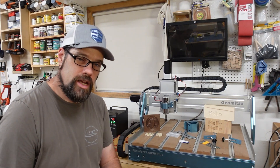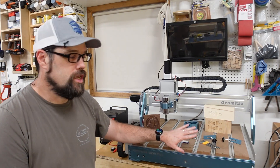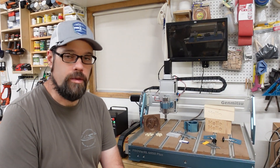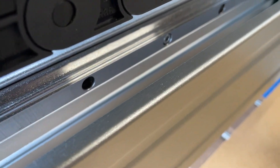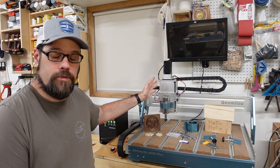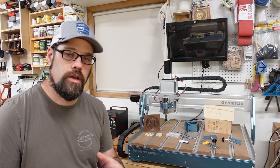It has a default setting of 2,000 millimeters per minute for its top speed, and I've heard from other people that they've pushed it even faster. You're going to need those robust motors to keep up those speeds. Along with that, they are using lead screws and linear rails — dual 15mm linear rails on the X-axis, dual 20mm linear rails on the Y-axis, and very thick linear rods on the Z-axis — to keep everything moving precisely.